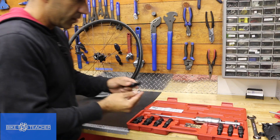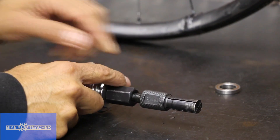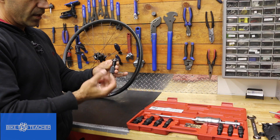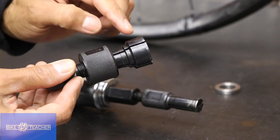We're going to grab something that fits inside — not too big, not too small. Once it's in there, we're going to make sure it catches just on the edge. There's a small lip on there. Then you're going to tighten this one — this tightens into the base here — and it's going to spread open those fingers and grab hold of that bearing. You've got these three little fingers. You see these slits right here?